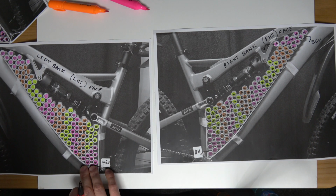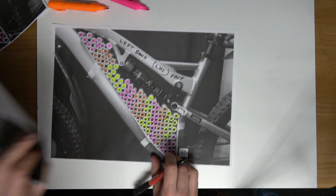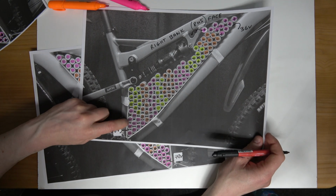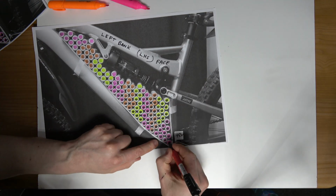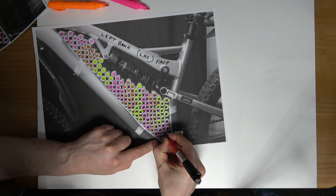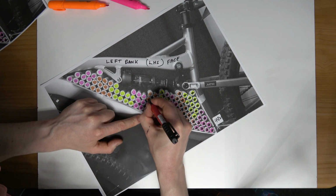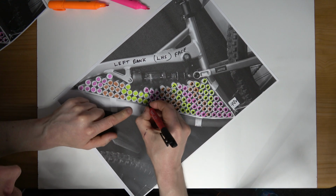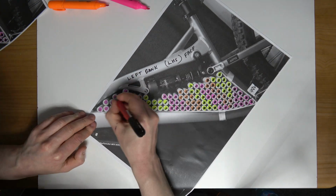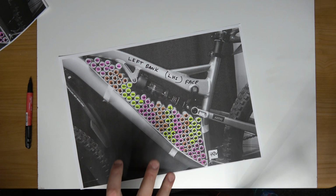So moving on now, I'm going to just mark out the polarity of the cells. Remember, at this side we have the negative poles of the battery, the negative polarity, and at this side we're going to have the positive. So I'll mark them out here. Flying now. The highlighted colour helps. As you can tell, I'm flat out. Okay, complete. Ready for the connections. So I just want to demonstrate here before we move on.